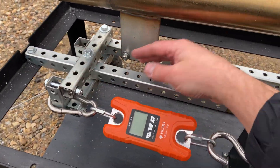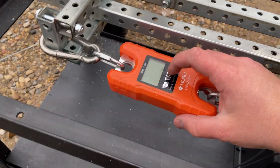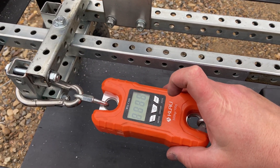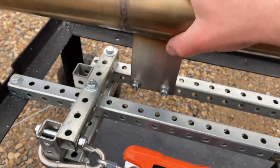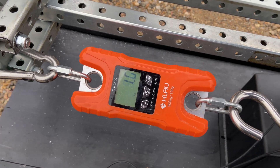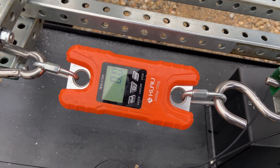There's a pivot point right here and also here, so when the engine pushes forward — I'll just turn this on here. Engine pushes forward right now, it's reading zero. But if I push this forward a bit, you'll notice — oh look at that, I got 10 pounds of thrust. So that's how I'm going to measure that.